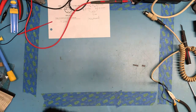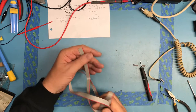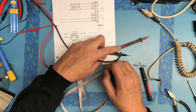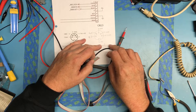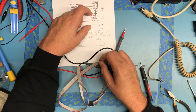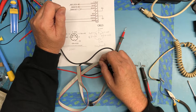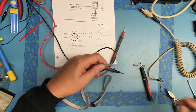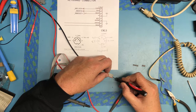Oh, that keyboard's nasty. Nasty, nasty. So, I've got a piece of ribbon cable here. I really need six leads because I need a lead to be the protective earth for the shield. 1, 2, 3, 4, 5, 6. I'm assuming that's key ground, and the two LEDs, at least I assume most fed off the two LEDs. Now I will zip six pins off of this, or six wires. 1, 2, 3, 4, 5, 6.